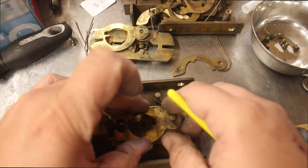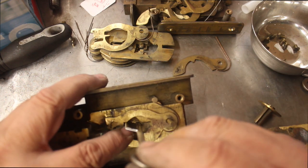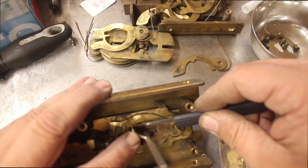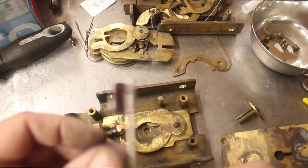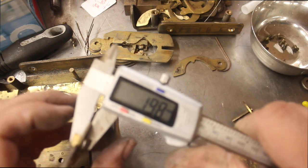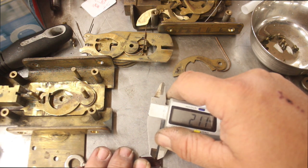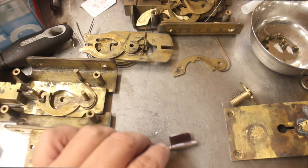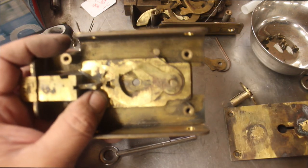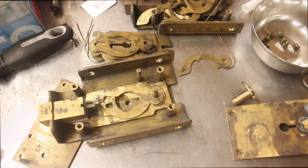I'm happy with the height. Let's put a lever in and start to cut it up. So that's the open position — let's go for our first lever. I need to know how thick I want it: measuring a lever, 1.98 or 2mm. I can go from my mark and give it a score — I've got two little lines there. Now I need to know how far up I want it to be. At the moment it's pushing all the way up, so this section here I need it to drop down. I can even use vernier calipers for that.